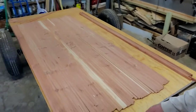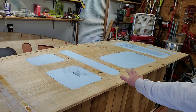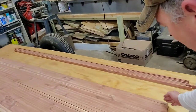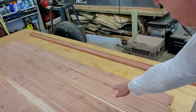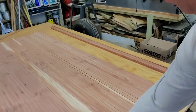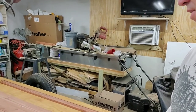Now we're going to make sure we're on the right side of this thing — yes, this is the interior wall. Don't mess up and make a costly mistake. Almost did that one time on my other wall. But where all of our strips are book matched — that means whenever I cut a strip I laid it down, laid the next one, the next one — so all the grains and patterns line up and you have a nice transition of wood. You can't tell from one board to the next that those are two different boards, because those boards were cut out of the same tree.